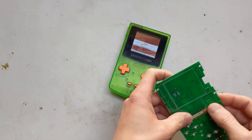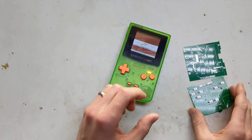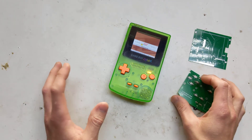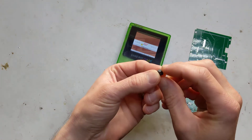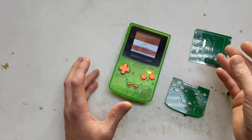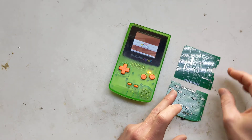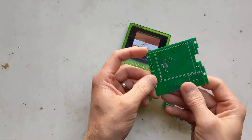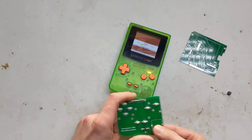One issue was PCBs - it was going to have to be a big PCB that was over a hundred mil long. But when I came back to this project, I thought why don't I just split it over two boards. One other thing that stopped me was deciding what to do about the controls, because some people like really clicky buttons, some people like soft membrane-y type ones, silent buttons, some people like to just use the membranes. So I thought I don't need to spin a whole board just for the controls - I can literally solder on any controls I want. The top board basically has the screen, the Raspberry Pi, all the sound, power and all that on it, and then the second board is just controls, a speaker, and a headphone jack.